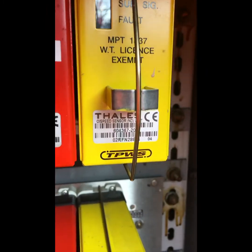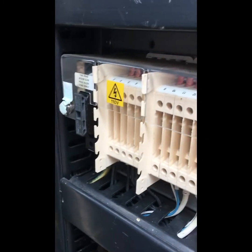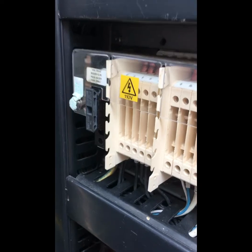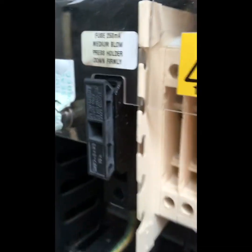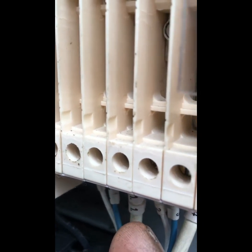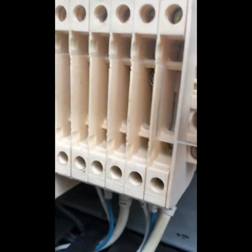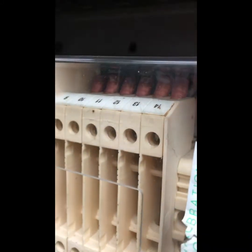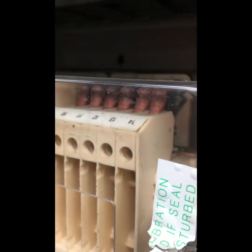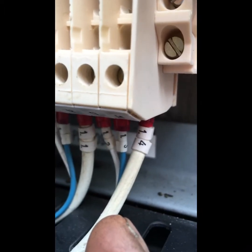This is the normal direction side and this is the over-speed side, used for the permanent speed restriction. On the rear of the modules on the base plate you'll see some terminals. We start off with our input AC fuse — the 110 volt AC fuse — on the positive leg one. Our terminals are labeled across matching the diagrams. On the far right-hand side are our output lines, which are shielded — that's what these extra wires are for. Wires go out to our links and then our loops out in the ground. There's a plastic shield over the top of the terminals; you can only put wires in the bottom and tighten them. The top wires are set at the workshop and you are not allowed to access them. All we're allowed to do is go into the bottom wires. We have two loops out of here — our first loop and our second loop.